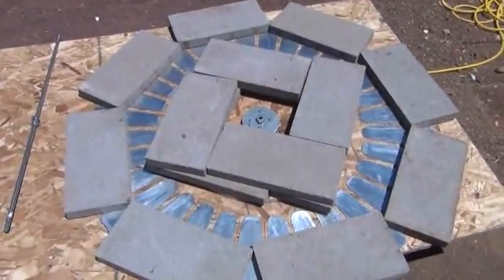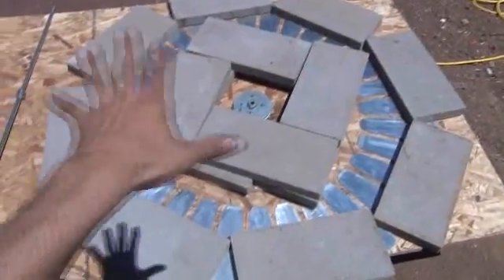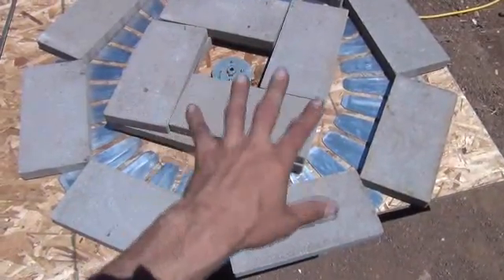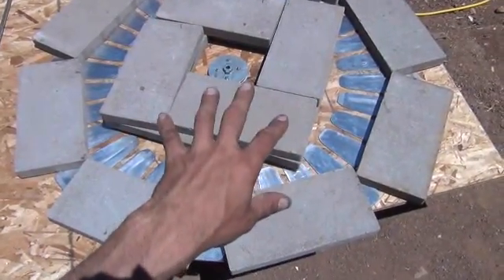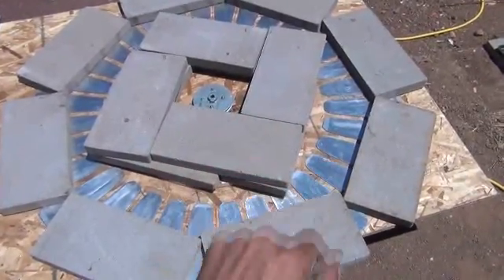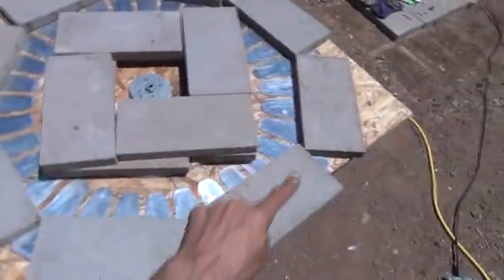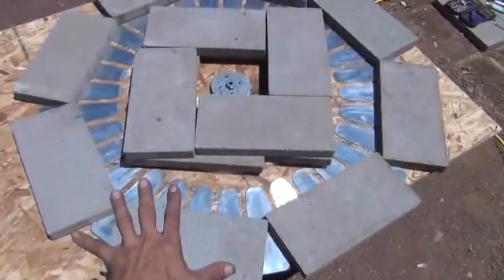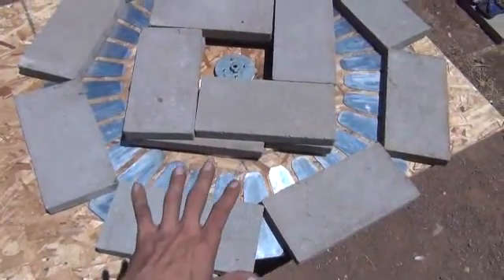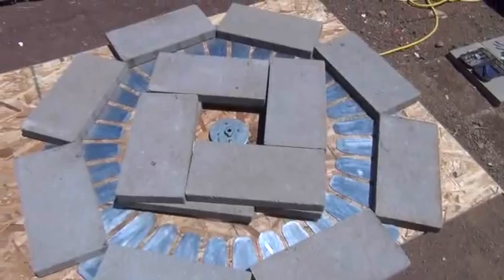What we're doing now is actually gluing the wooden disc onto the plexiglass disc. You can see I've got cinder blocks packed all the way around it — I'm using those as weight to help hold the wooden disc on while the glue dries. We have a clear epoxy designed to bond wood to hard plastic, and you want to make sure it says it's designed for hard plastics. The outer ring here is making sure the outer ring of the disc isn't going to fold up. I noticed the heat from the sun was kind of warping it slightly, so we might have to do something about that.